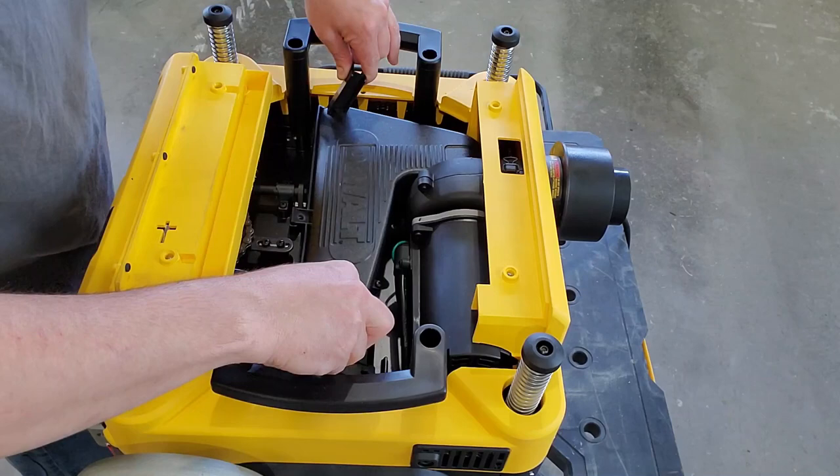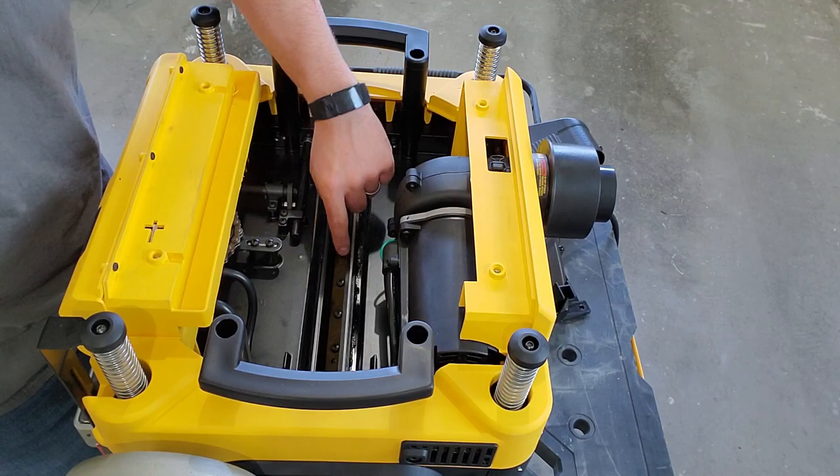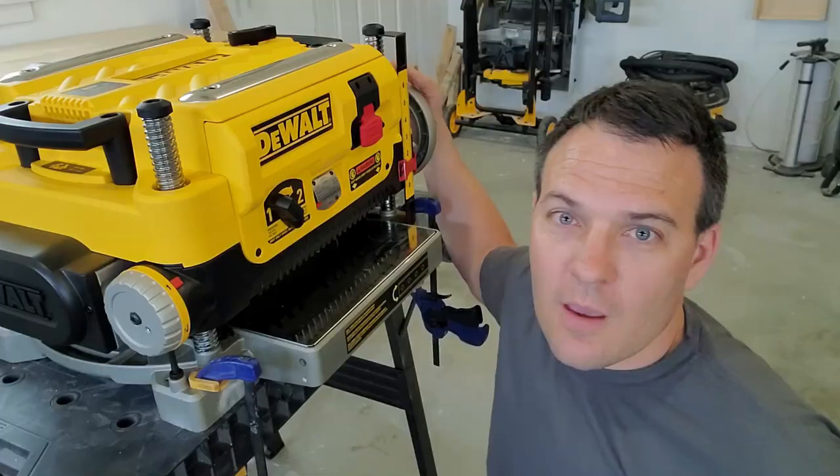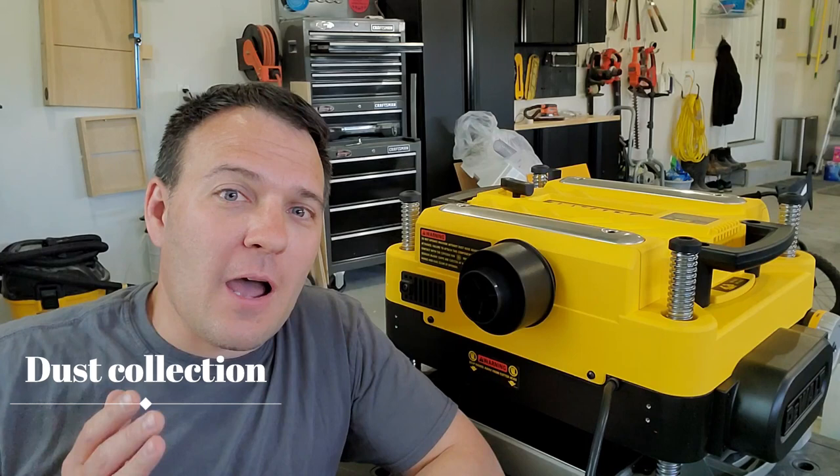It has a 3-knife cutter head with 10,000 RPM cutter head speed. It has fan-assisted chip ejection, so it actually sucks the chips off the cutting head and shoots them out the back. It comes with an auto carriage stop and a turret depth stop so you can return to commonly used thicknesses. So now that we've gone over all the cool features, I want to set up a dust collection bag